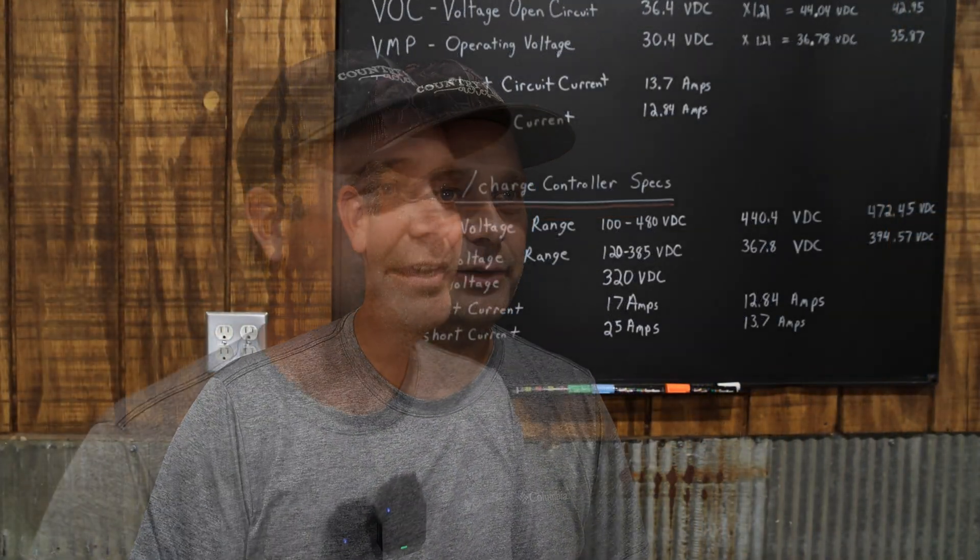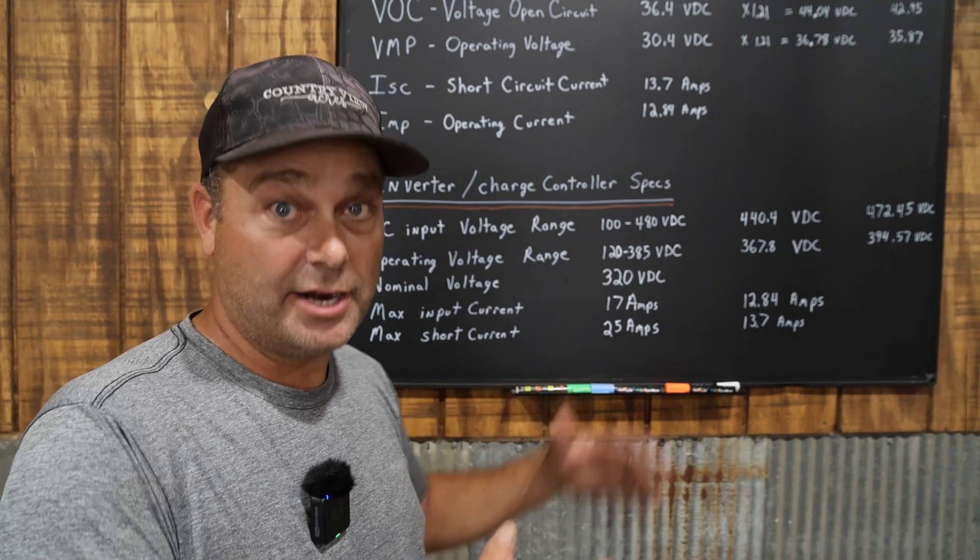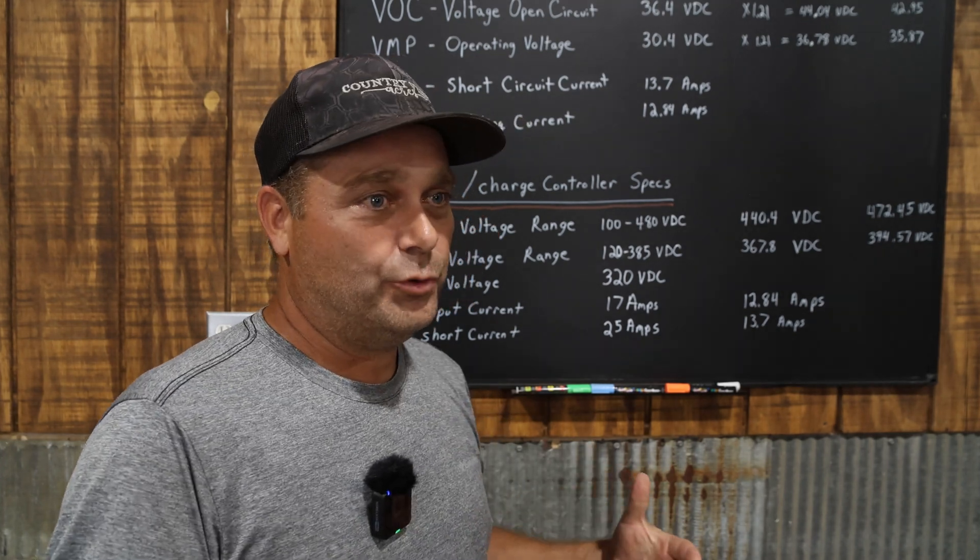How did I come up with minus 20°F? Last year we got down to negative 6 for a few days, and back in 2017 it hit negative 10 to negative 15. I've known other years where it got close to negative 20. I'm looking for the lowest temperature not just next year, but over the next 10 to 15 years — the whole lifespan of this system — to guarantee I don't over-voltage it. Over-voltaging can destroy your equipment, and when it gets that cold, that's when everybody else is out of power. I want to guarantee my power stays on.